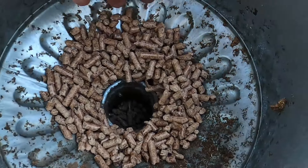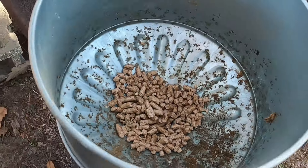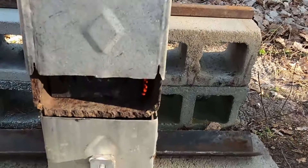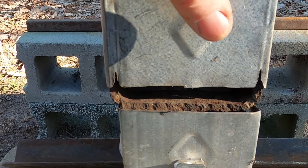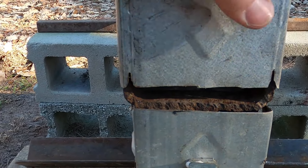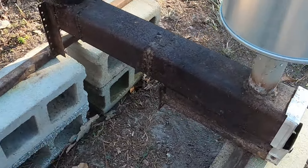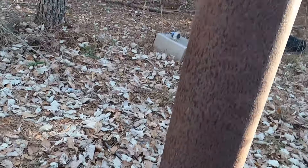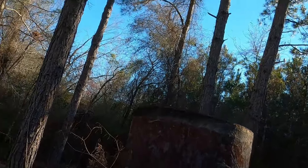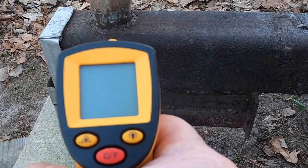You see how much pellets has burned through since we just poured them in there. But like I say, that can be controlled by closing this air off some - don't let it burn so fast. You can close that down and open that up just a tad and let it burn not quite as fast and not as hot, but still get plenty of heat off of it. You can see just how little it's smoking right there.